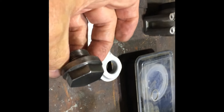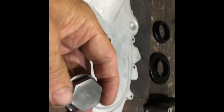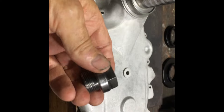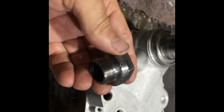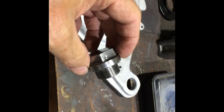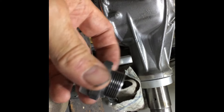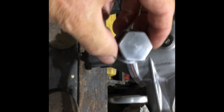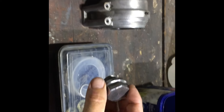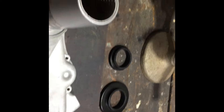I'm just going to go with that until I get a new one. The problem is I'm finding it very hard to see what I'm doing when I'm welding because I wear these plus-three glasses - all I can see is a big bright light lately. Anyway, I'm going to go and buy a 25 by 1.5 tap. I just want to clean that thread before I use it because I don't want to stuff the thread up on the housing with welding splatter in the thread.